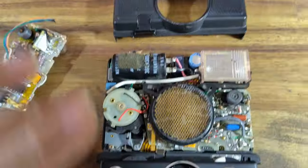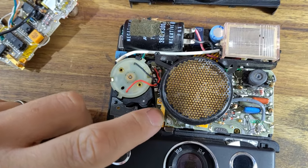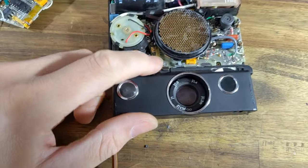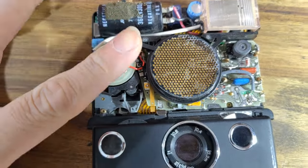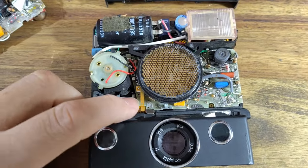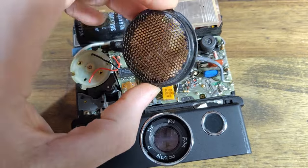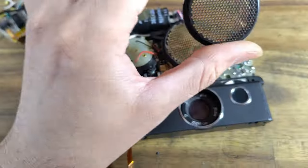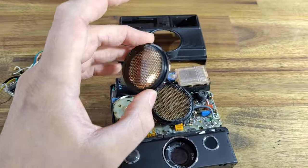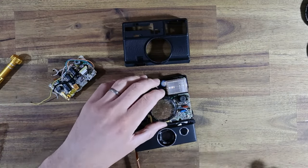With that bit missing, this is never going to work. I wonder: has the autofocus mechanism been completely disabled by some repairman? Because that would be one way to do it — I have seen these switches disabled before, where a client would say if it's too expensive to repair the autofocus, just disable it so I can manually focus. To find out, we're going to need to install that switch back in. The transducer is also totally trashed and super dented. I have one from a Polaroid 660AF in immaculate condition — they are the same transducer, doing the same job despite coming from a 600 rather than the folding SLR. So I'm going to swap that over as well.